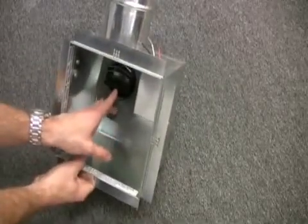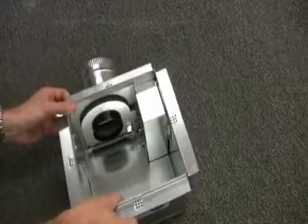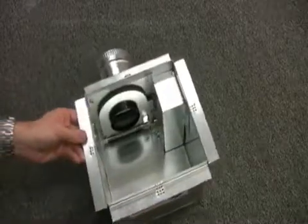With this ZRT there's a small constant airflow regulator built into the damper door. This allows a small amount of air — say 10, 20, or 30 CFM — to leak through the system all the time, constantly removing any pollutants that build up in the house. When you need to boost ventilation for humidity removal or normal bathroom use, you just hit your switch or timer like you normally would.